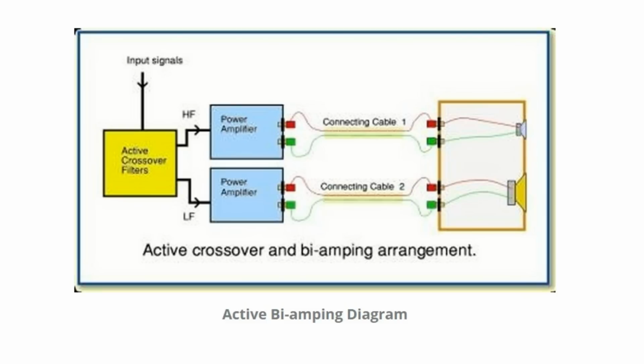The other thing is you have more control over the filter coefficients, because when you do things electrically, especially with active crossovers, you could control the slopes, the Q. I mean, it's far more precise than when you're using passive networks. And believe me, I'm not dissing passive networks. Some of the best speakers in the world, for example, our reference speakers, still use passive networks. But it's very expensive to do a really good passive network precisely. And you saw the crossovers in our reference speakers. Yeah. I mean, the inductors are the size of transformers and amplifiers. Yeah, for real. So, there's pros and cons to both, and that's another topic for another video.